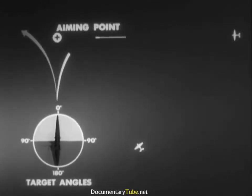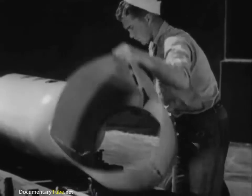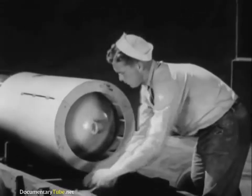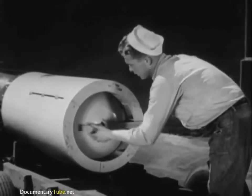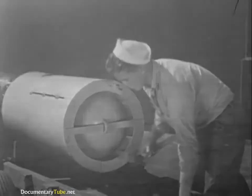Dowels which shear on contact with the water. The drag ring has two primary functions: to aid in air stabilization and to decrease the impact shock about 40% on hitting the water. This is especially useful in cases of extremely high altitude drops. In a torpedo drop, any deviation from true air trajectory is liable to cause damage on impact. The drag ring helps to eliminate pitch and yaw. Like the stabilizer, this disintegrates when it hits the water.